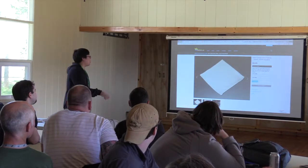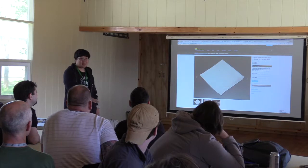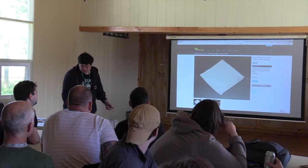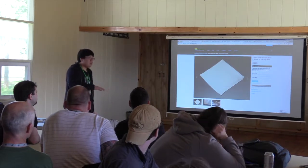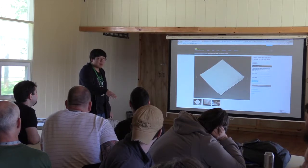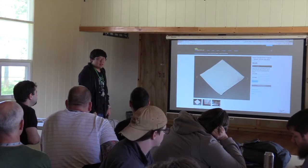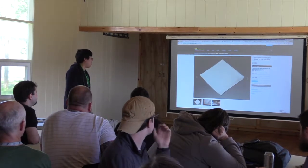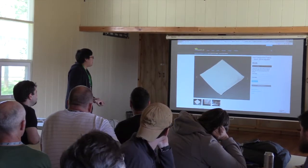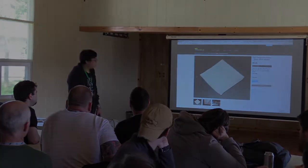You really want the stretchy kind, because that's what will get all your nooks and crannies. I used one that was not as stretchy, and the problem with that is that if you push it down on certain pads or just brush it, you won't get good contact with some of those pads. Sometimes you might have to clean up the board beforehand with some isopropyl to get some of the oxidation off.